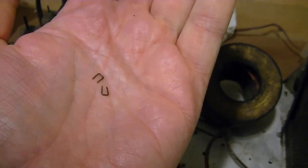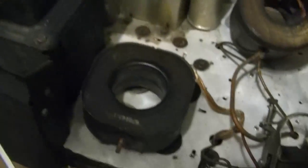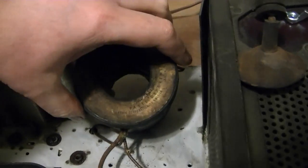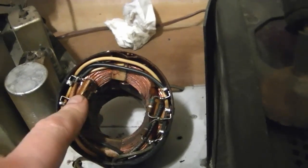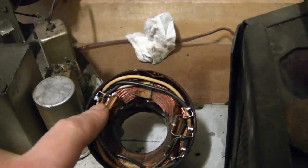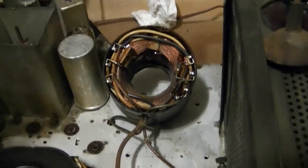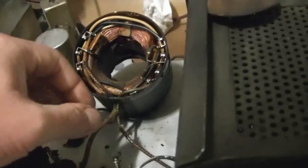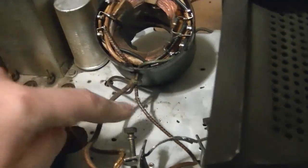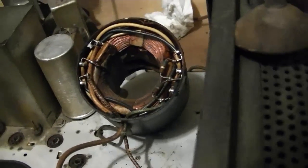A careful examination of that yoke cover revealed two tiny little staples, which I carefully removed because I want to reuse them. Now this cover comes right off. There's the two 560-ohm resistors, and there is a compensating capacitor for the horizontal windings. If I really wanted to check this yoke like I was trying to do earlier, I could take these resistors out and use that yoke tester. But what I want to do is replace at least one of these wires. The other two have plenty of slack, but the one right next to it is as tight as can be.